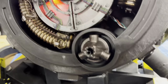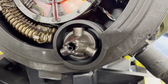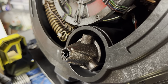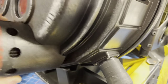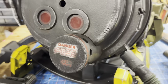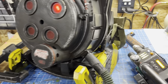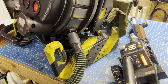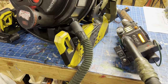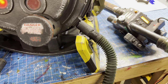The smoke exits through the cone under the end filter. There is a 50-millimeter blower fan underneath that allows any smoke built up inside the end filter to be pushed out — I found that to be pretty effective. That's also part of the base design by GP Star. He already has pins defined and software that will automatically run the fan at the right time during the pack vent sequence.